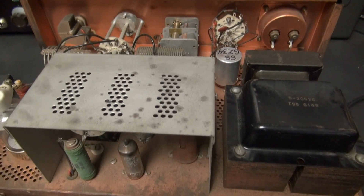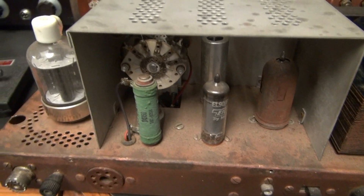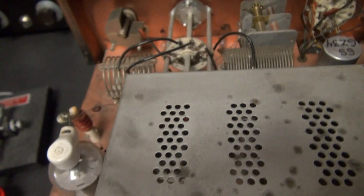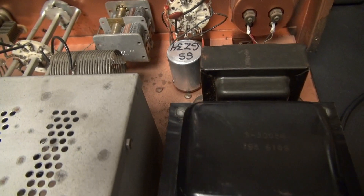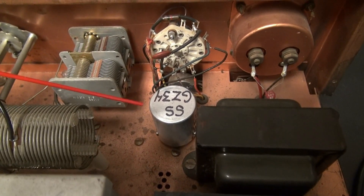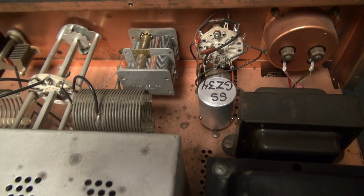Here's the top side tour. If you look back here, they've got a little cage with the old oscillator circuits in there. There's the 6146, your matching network, power transformer back here, metering, and down here is the solid state GZ34 replacement, rather than that expensive tube.